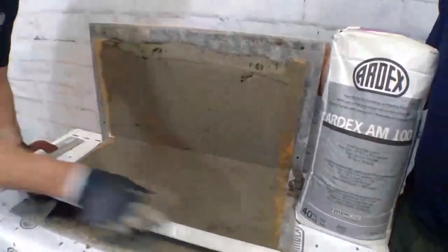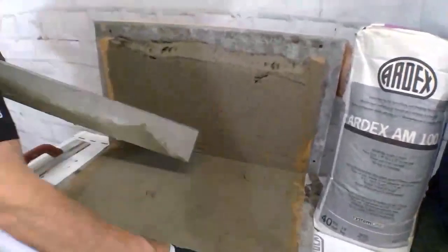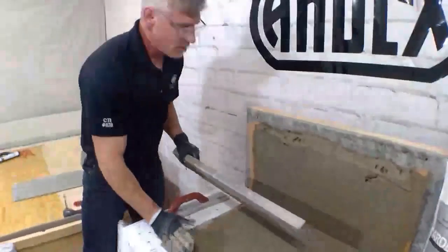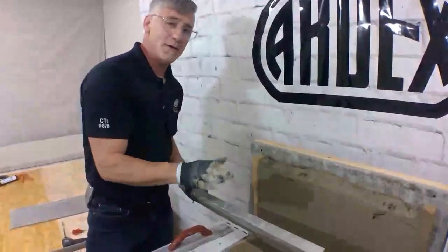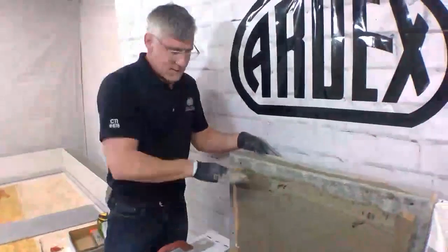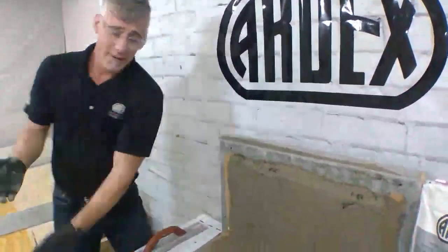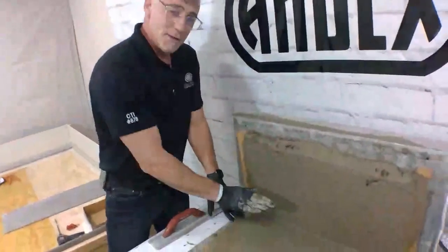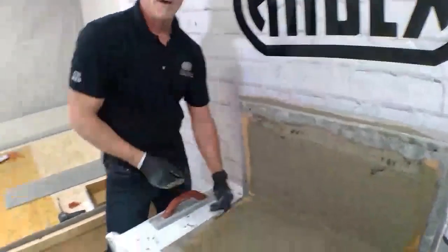William, Captain Ford has a question. Could you use ARDEX 8 plus 9 as a primer for AM100? No, we need to be in direct contact. AM100 will always require direct contact to a concrete substrate, so we don't want anything between it. We don't want waterproofing. When we're talking about waterproofing, we always want it as close to the tile work as possible. Typically a waterproofing like ARDEX 8 plus 9 can also act as an anti-fracture membrane, so we always want that as close to the top as we can, and that way we're preventing the substrate from being saturated with water.